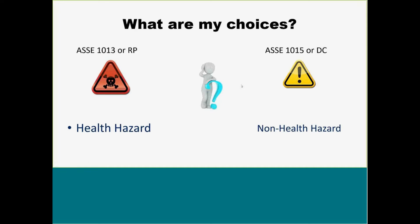One big thing I want to tell you guys, especially those in the wholesaler business: do not make the decision for your plumbers. Make them tell you what they want. Don't get in the habit of recommending one and lining yourself up for trouble, because they will come back to you. But if they ever make you make that choice, always go with an ASSE 1013 or an RP — they're the exact same thing — and it's going to cover all your bases.